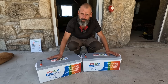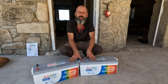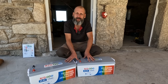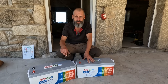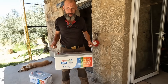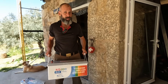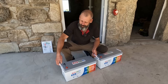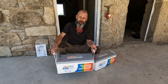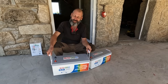Each battery is 24 volts 100 amp hours. Connecting them in series makes a 48 volt system with about 4.8 kilowatt hours of storage — I think that's amazing, especially for us, as we used to live from a little tiny power bank. They also include a built-in BMS battery management system which helps to protect them from overcharging, short circuits, and whatever life can throw at them. They are quite compact, lightweight, and clearly labeled, which makes the installation really easy even for a person without experience.